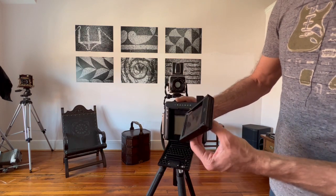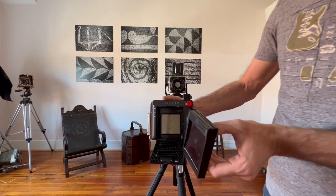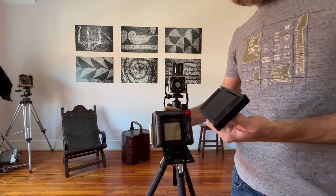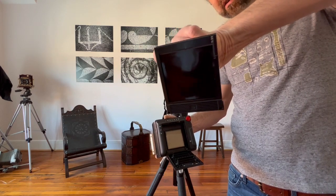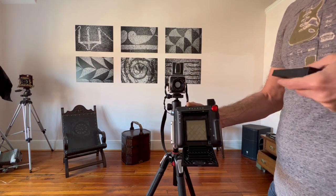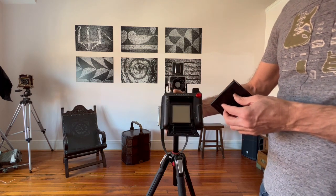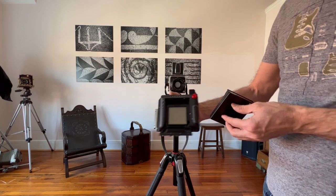protruding. It's supposed to touch the surface of the film gently and provide some amount of pressure on it, so it's constant. It also flattens the film, because the film in the cartridges is never flat. It's that way because of the chemical parts. The fiber optic plate is attached with friction. It's not glued in place. I want to avoid cracking, but it also makes it sensitive to jolts.